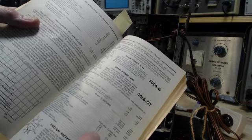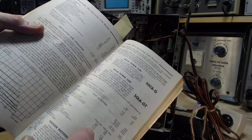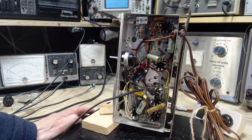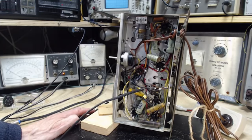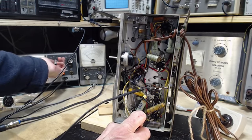At 110 they don't have fixed bias here. You'd think it'd be a smaller resistor, but it's 220 in this radio. Well, why is it? So if we look at the cathode, then cathode is 8. 8 is right here. So this should read a positive. I'm getting this a little mixed up here.